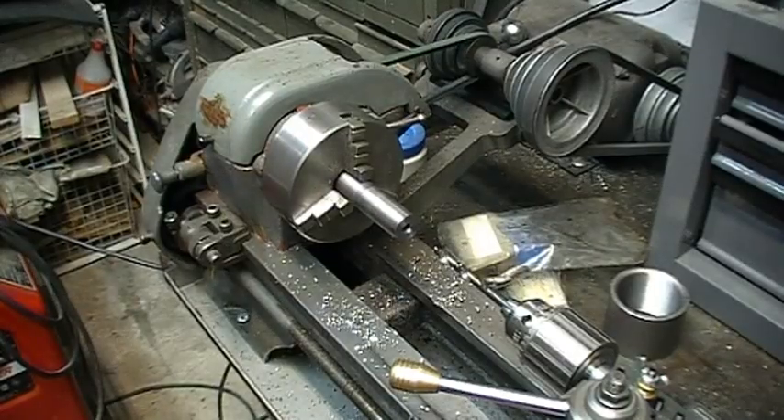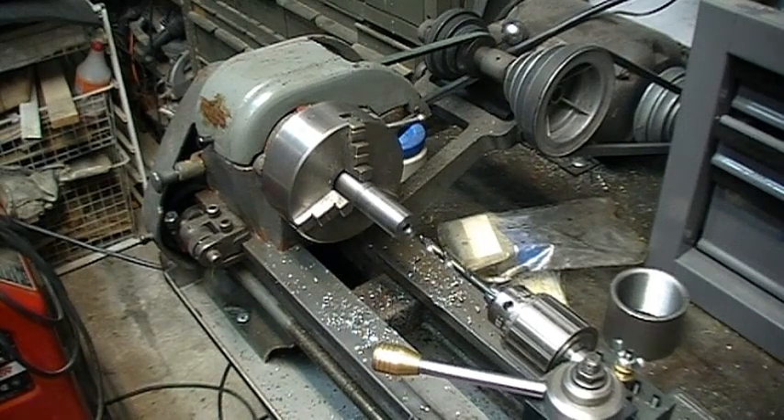Obviously this could be done on a larger lathe as well, and on a heavier duty lathe you could use the power feed. However, I strongly discourage using a power feed on one of these mini lathes — it's very hard on the half nuts, and on Chinese mini lathes with plastic gears you may break or chip the gears. That wraps up my Tips Blitz 19 tip of the day for deep hole drilling on a mini lathe.